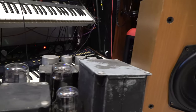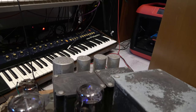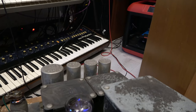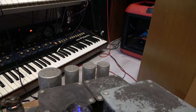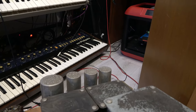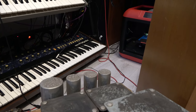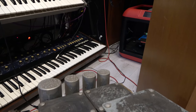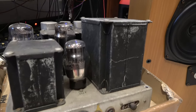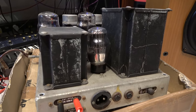I'm wondering if it's to do with the smoothing capacitor, because that sounds very like the kind of stuff I have with synths when smoothing capacitors are shot or not working very well. I did reform them, but maybe they're not good enough. Plus I also didn't check that one that was really leaked - it did seem to start to reform but it may be no good. So I'll have to investigate that. But I'm pretty pleased that I'm actually getting audio out of this thing and it is working, which is quite a result.